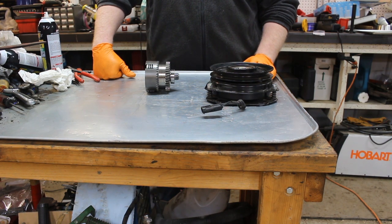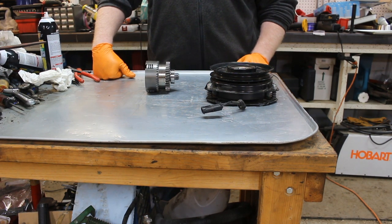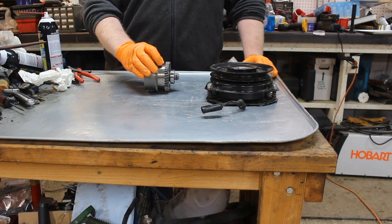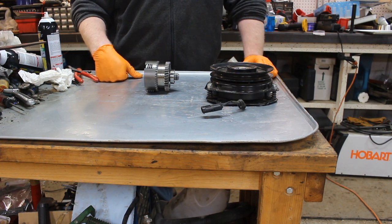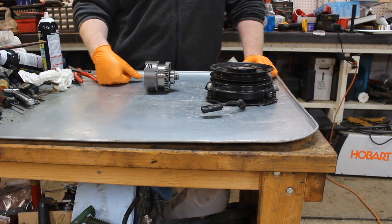Each one has their perks. The dry clutch is obviously a lot easier to work on because it's in front of the engine — you can take it on and off, change out bearings, things like that. Meanwhile, this wet clutch system is much harder to get to. I'll walk you over to a K91 transaxle in just a second. I did take apart a K91 transaxle several months ago, so I'll try to put a link to that series in the description. The wet clutch pack is much harder to get to.